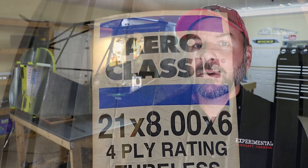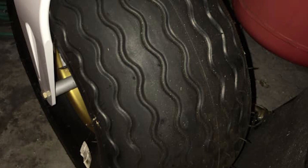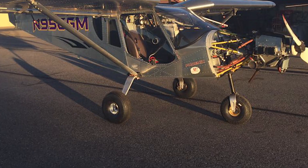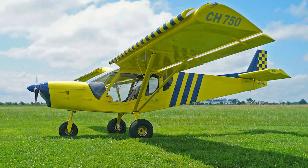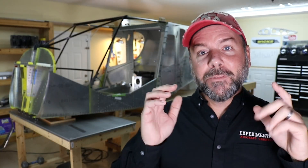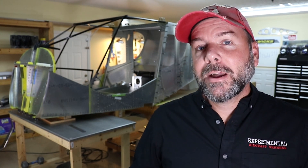The option is a 21-inch tire on the mains. Factory size on the nose wheel and going up to the 21-inch tire on the mains. I know there's going to be a speed penalty for doing this because the Cruiser had the smaller tires plus wheel pants, but I feel I would rather give up a few miles an hour of speed for the safety of having bigger, cushier tires to land on when I go visit you at your off-airport location.